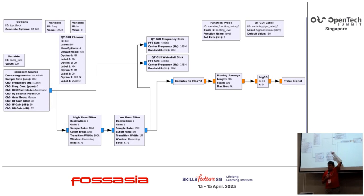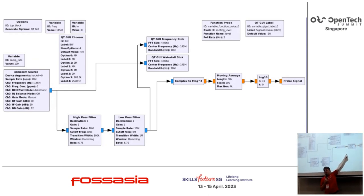What's important about it is that so far you're looking at voltage. Here, however, if you multiply them together, you're now looking at something that varies with power. Power varies with voltage squared over impedance. So you've got a series of samples here that are linear and proportional to voltage, which is great. You need to multiply it by a constant. What constant? That's the calibration problem.